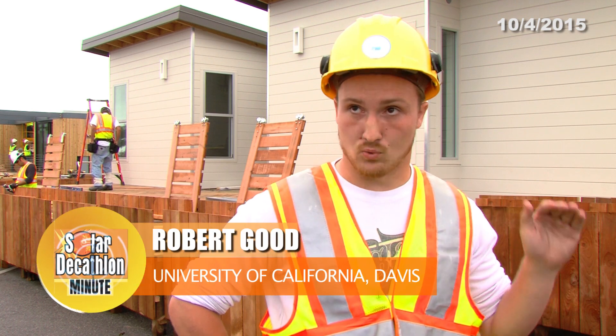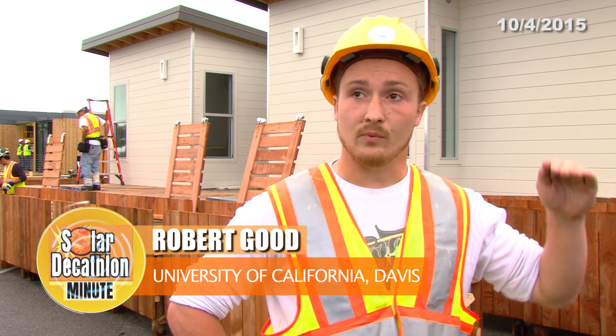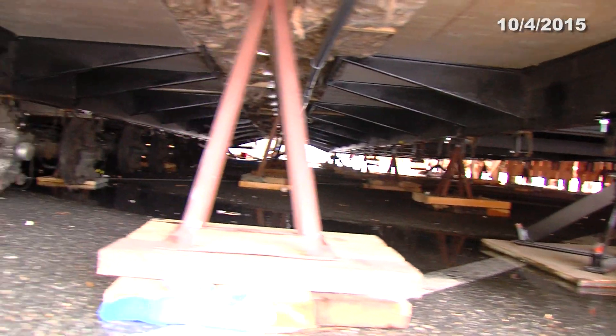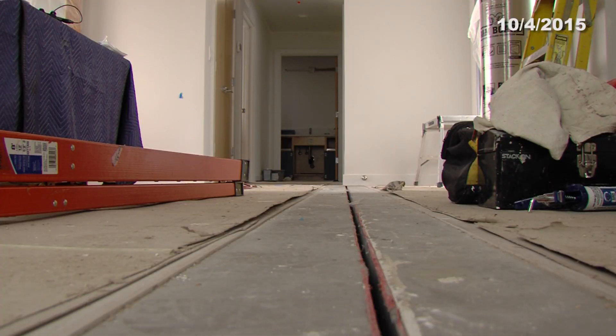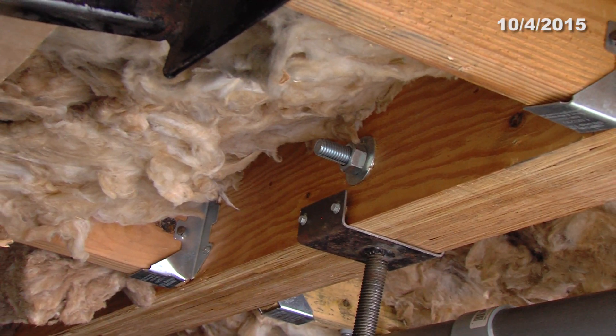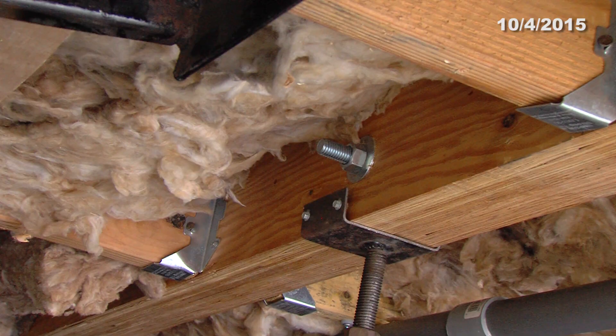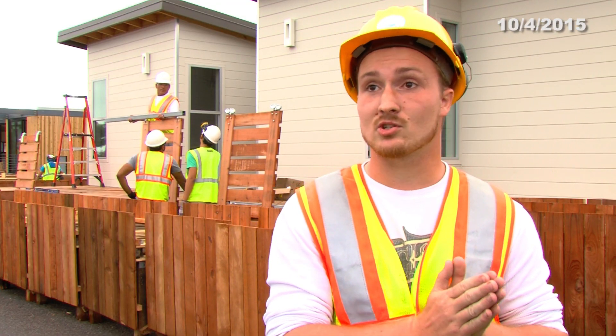The roller systems required going a little bit lower just due to the slope. We fixed the problem by dropping the axles and dragging them from under mod B. Once that was done, we had about an extra eight inches of room underneath the house — we only needed four. At that point, we could bring the home together and lift it up very slowly until the juncture between the two modules was perfectly met. We have 24 six-inch-long bolts on the bottom and 24 bolts on the top, and that is the structural connection between our two houses. It's extremely quick and extremely easy.